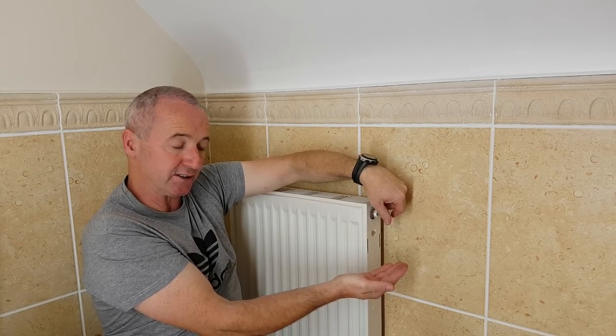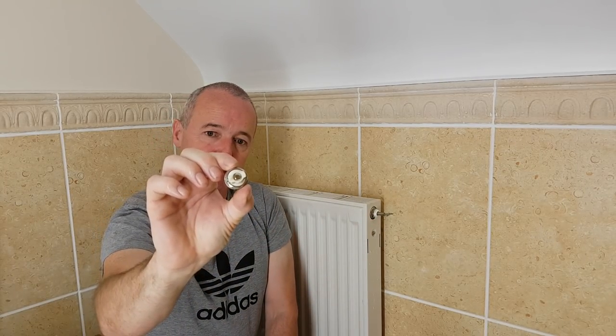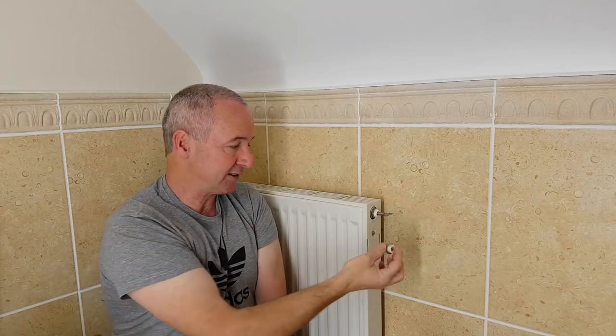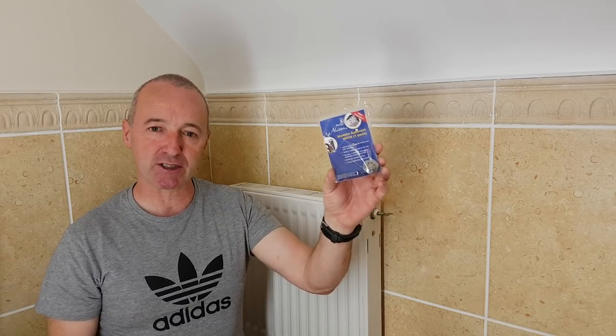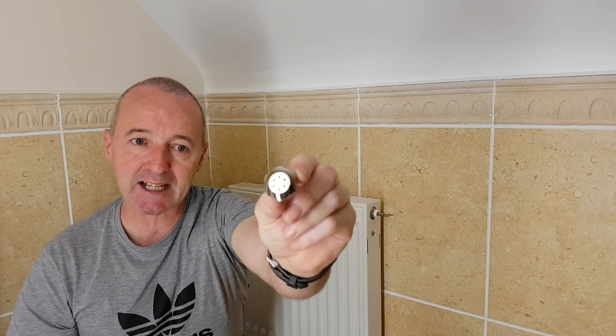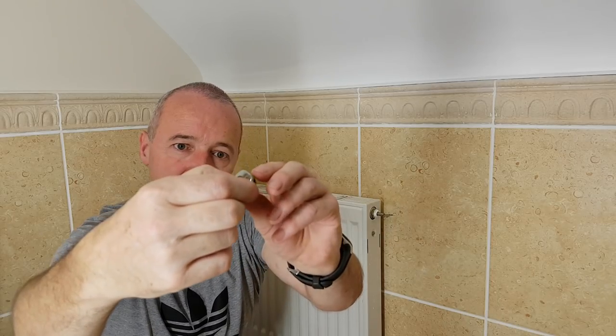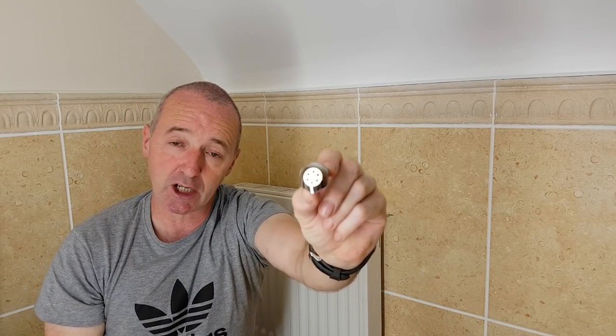There's no air in this radiator — that was just pure water out of it. In operation, this radiator would heat all the way to the top. This is the standard manual vent every radiator has for purging air. I'm going to swap it for an Aladdin HV-30 auto vent, which removes the need to manually bleed — it'll do it automatically. Here's a closer look at the HV-30. If you're interested, there's an affiliate link in the description below.